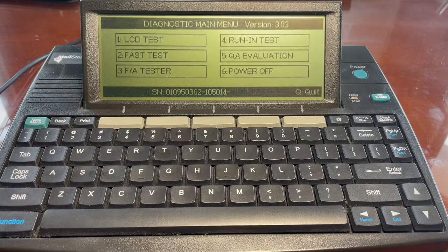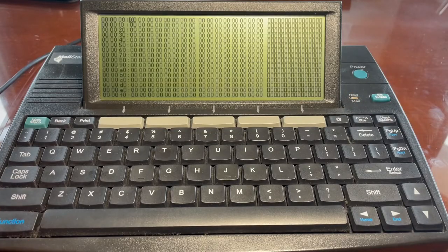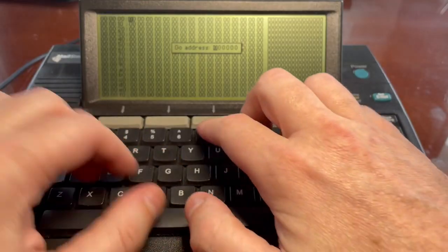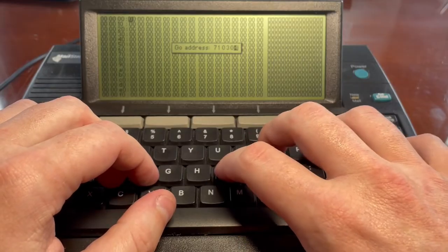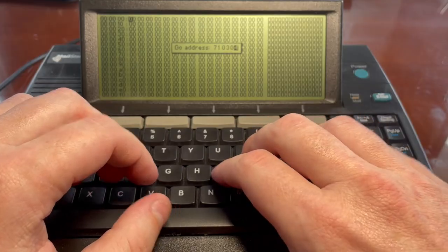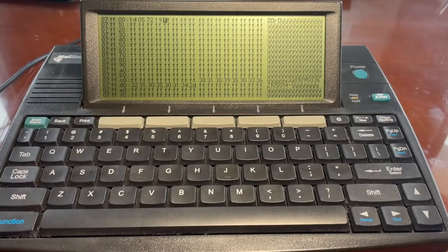Enter the hidden hex viewer editor. Press shift and the rightmost unlabeled button under the screen. Okay, shift and this button. Wow! You should see the hex viewer. Press the G key and it will prompt for an address. Enter 710304 and then X, which will not appear, then enter. This unlocks the ability to enter a write editing mode. Wow, this is like real movie hacking.